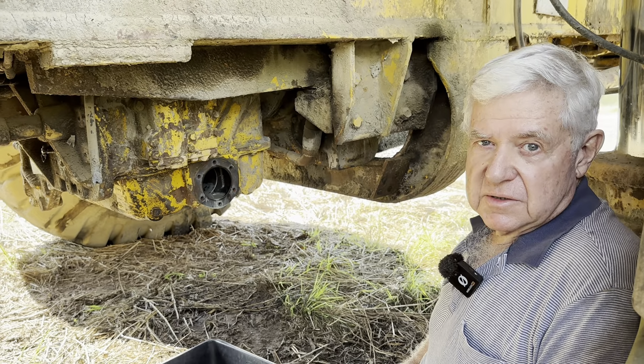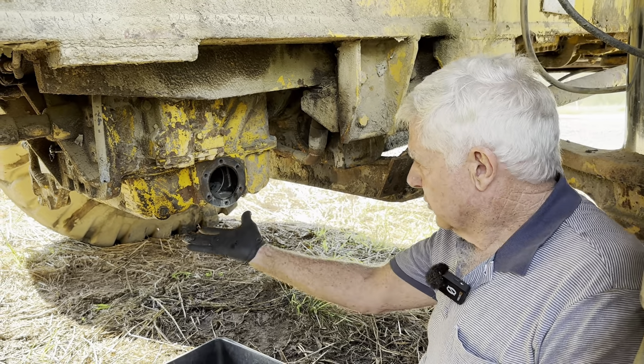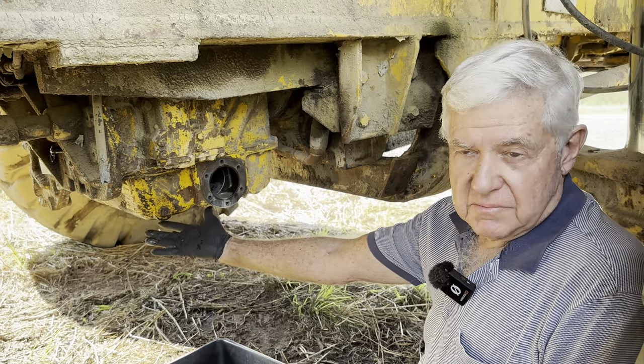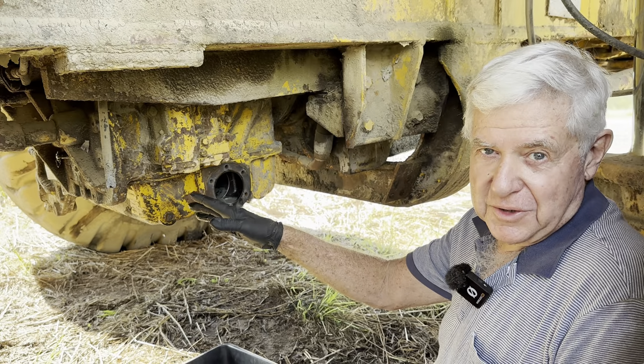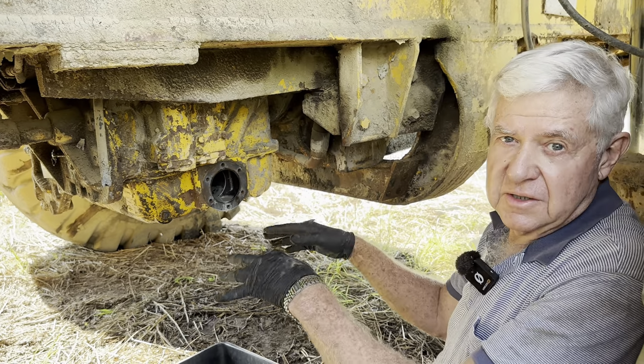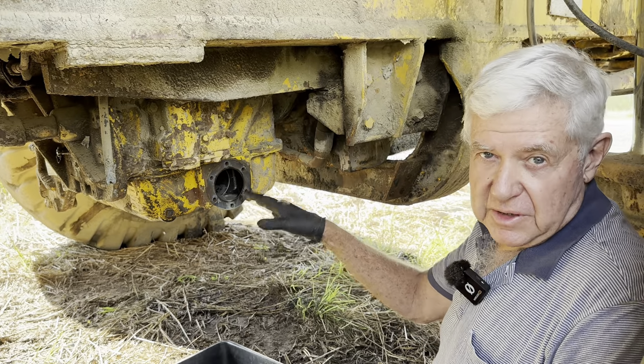If any moisture gets into the system and it's not being started and circulated, the water and everything will always be laying on the bottom. So in a case like this, you're checking the oil level up at the top, so the oil can look quite clean. Of course, the oil can settle out over 20 years or whatever the thing would have been sitting too. If there's any sludge or anything in there, that will go to the bottom.